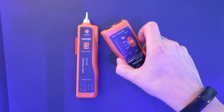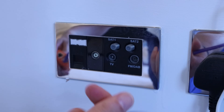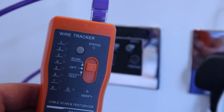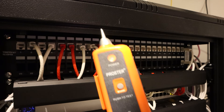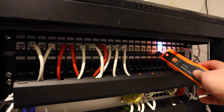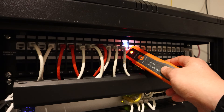You might be wondering how I know which socket goes into which port on my switch, given that it was all previously configured into separate VLANs. Well before I started I took note of what needed to be plugged into a specific port, but for everything else I really recommend one of these network cable tracker tools. There are two parts: an emitter and a receiver, and they both run on a 9-volt battery. You plug the emitter into the port you want to trace into your patch panel using a normal network cable and set it to scan. You then take the other end to your patch panel and touch the probe against the metal pins inside each port. When you touch the port that is connected to the emitter it makes a beeping sound, so you know that this port on your patch panel corresponds to that outlet in your house. It's a fast way to figure out what is what, and this tool also doubles as a cable tester, which is really handy.